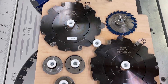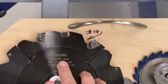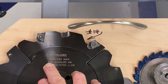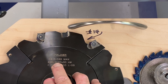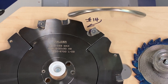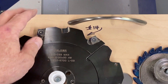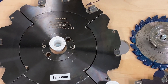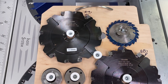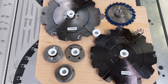The larger cutter goes from 12 to 20 millimeters, with a 30 millimeter arbor. In actuality, when only the two blades are put together with no spacers between them, it cuts 12.33 millimeters. I've marked that base width without shims on all my cutters by doing test cuts.